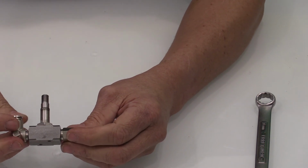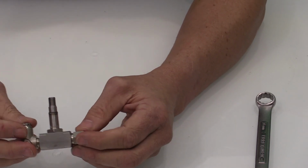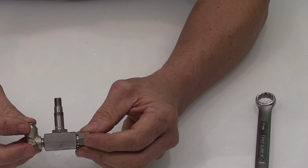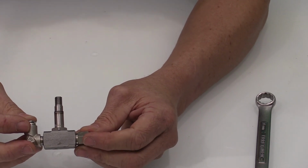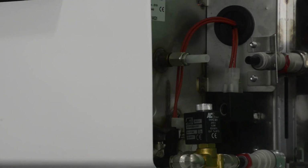We'll go over to the humidifier, put it back in, turn it back on, and our hope is that that's going to clear the alarm, if you've already determined that your fans are operational and your transducers have been running prior to that alarm. So we'll go over to the humidifier now. All right, now we're over at the humidifier.